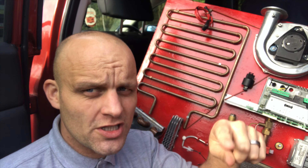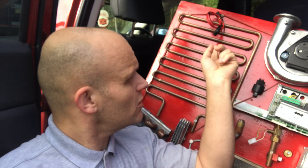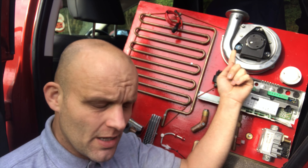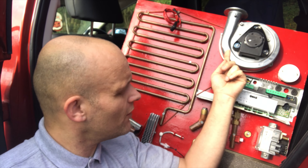Here's the HT lead. Look for a spark — you should get an F4 sequence for it. You're looking at about 1,000 ohms resistance through it. The fan will also be F4, which will be fault code 8, running on 240 volts.